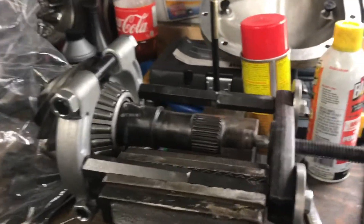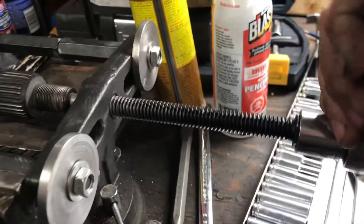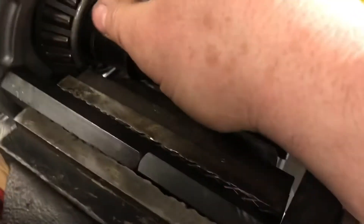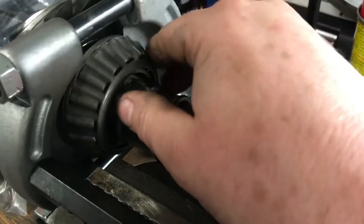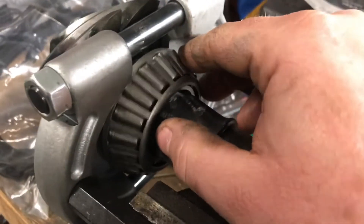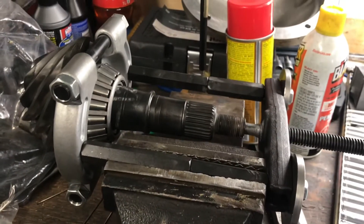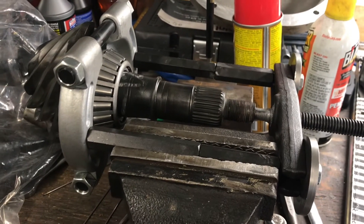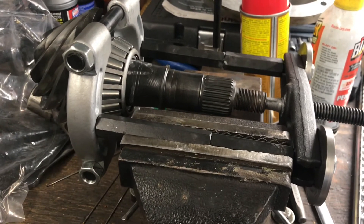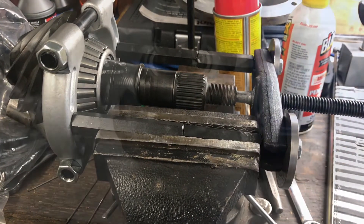Here's how I got it set up in the vise. I just clamped on this upright piece into the vise and I'm using a three-quarter inch wrench. I've already tried this a couple times so I know it works. You probably can't tell but it is moving the bearing off as I turn. Always check to make sure you can still rotate your bearing - if you can do that, you know it's not having force put on it by the puller. This bearing's gonna come off without much trouble and we'll get that shim out.